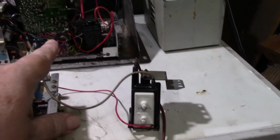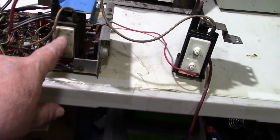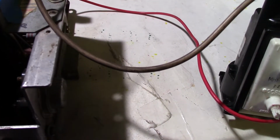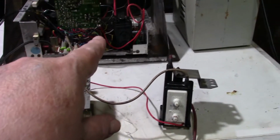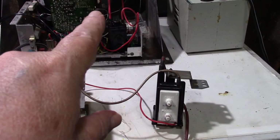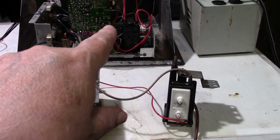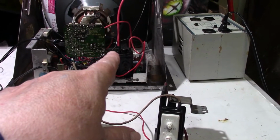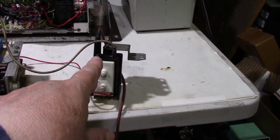If that's the case, then I'm going to have to source an original Flyback, okay? But I still want to rule out any possibility that the repo Flyback is different than the original. I haven't looked it over real good yet, but I'm going to look it over good for cracks. I'm going to remove it out of the chassis, and we'll install it. And if we get the same exact thing with an original Flyback as we do with the repo Flyback, then I could come to the conclusion that, yeah, this will probably work fine in a 4900, but it's not going to work in a 4800. So let's hope that this one holds together when I give it a try.